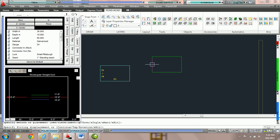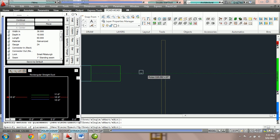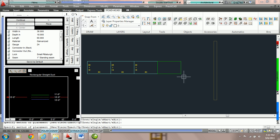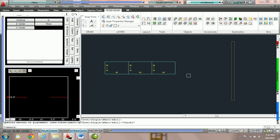If I hit C for continue, every mouse click will add one piece. You'll notice that as I route duct and hold the crosshairs, the duct is not following or stretching because we can only do one piece at a time. However, we can switch from piece to different methods like exact or smart and route multiple pieces of duct on the drawing at once.